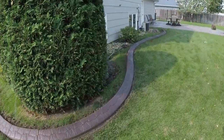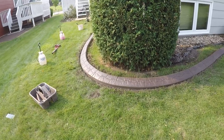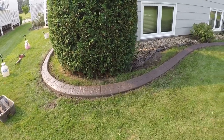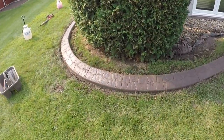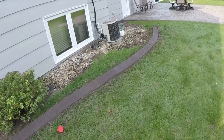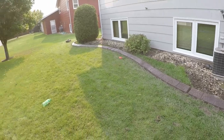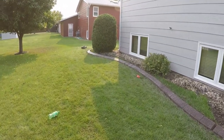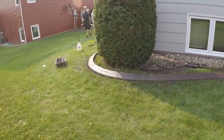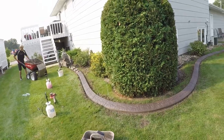Random Rock stamps, Ossie Cobble, and some of the others are pretty aggressive rollers. A lot of guys don't like to do them and will just strictly do a Spanish roller, slate, or something that's not as aggressive because they get a lot of tearing. Well, that's not because of the stamp — that's because of other things: what sand you're using, what your mixing ratio is, what chemicals you're putting in there. You can't just do the same thing for normal gray curb that you do for stamping, especially aggressive stamps. That has to be adjusted for what you're doing.